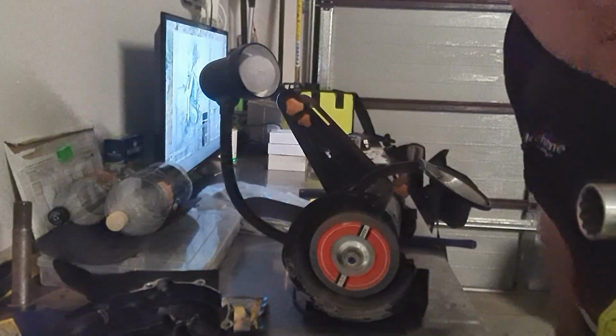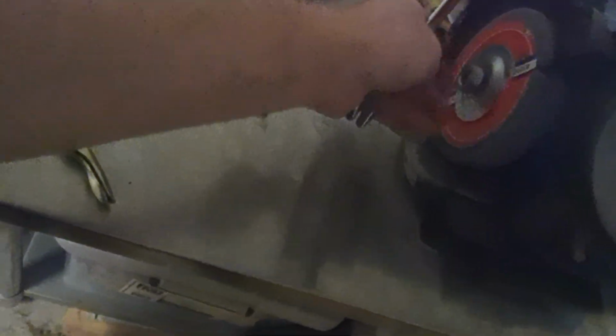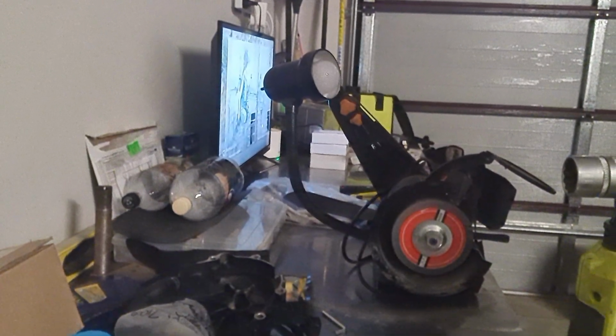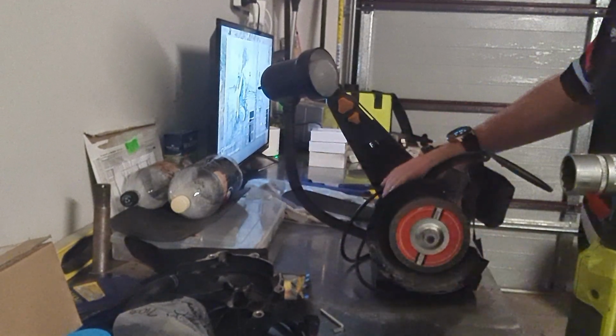What is a nice way? Cool. So that's what it was. I'll bring it around here so people can see. There's an actual nut on this side. So rather than break anything else, I held this side. They're both 19s. Held this on with this side, came back over this side, and was able to undo this one. So, excellent. Easy done. Rather than breaking it and trying to hold with vice grips and stuff like that, you just do it properly. Just do it properly once.